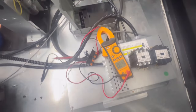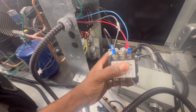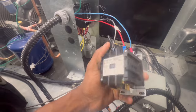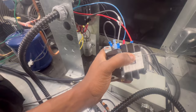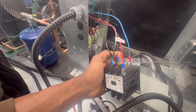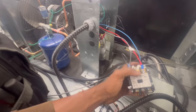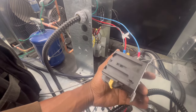Make sure your power is disconnected. Alright guys, if you're not good at remembering wiring, take pictures of it or wire it wire for wire. This is pretty simple. Sometimes I remember, sometimes I take pictures just to be sure. Our main voltage is coming through this way. Back here is our control side - this pulls in the contactor. This blue wire goes to that controller, so it's calling for cooling and all that.